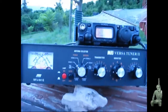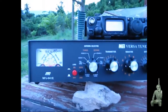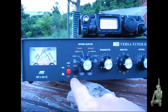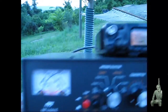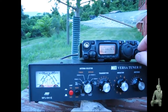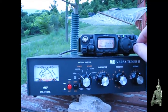I have the antenna already kind of tuned up for 14 megahertz with the coax in the tuned position. This is only a 5 watt radio on a 30 watt scale, so we're not going to see a whole lot of movement on this needle. But on the display it's 14216 megahertz. I'm going to make sure we don't have any traffic because we don't want to interfere with anybody — and that's an empty channel.